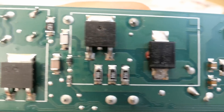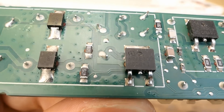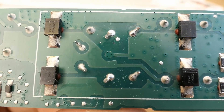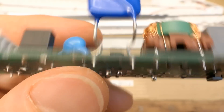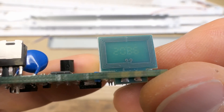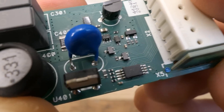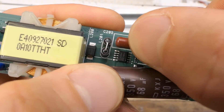The power factor correction diode, the transistor, the NTC thermistor bypass transistor, the bridge rectifier, and the interface here. There also seems to be some remote control or interface - there is an antenna under this plastic cover, and it goes into this chip, and also some circuitry hiding under these capacitors.